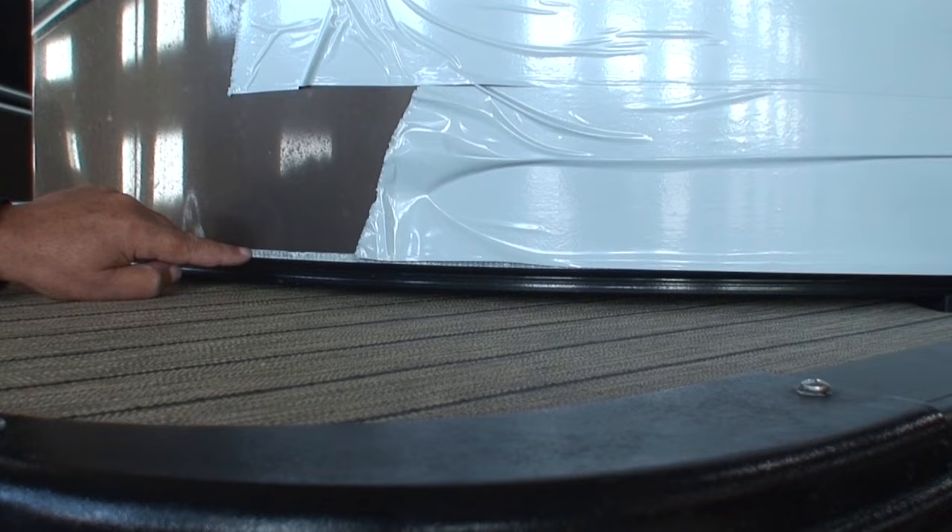You'll notice that this is real stitching — not the pressed stitching like we saw on that boat in the shop. Underneath our seats, our roto-molded seat bases. We use that because number one, it keeps our gear up off the floor so it stays dry. There are drain tracks so if it rains, water would channel away from the storage compartment. Even if you did get water in there, there are drain tracks at the bottom of the rotocast seat bases and it'll drain out the deck of the pontoon. Your gear stays dry, and it is vented so you'll get some airflow through there.